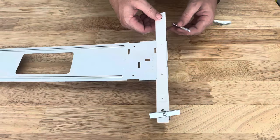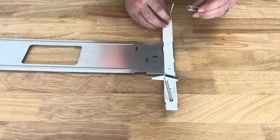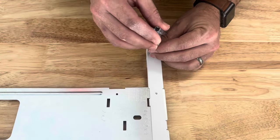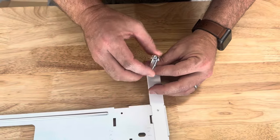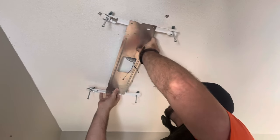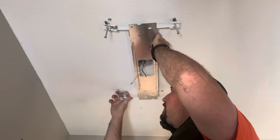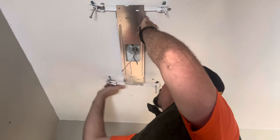That's why we need to wear glasses. You want to put these screws through so the flat side — which would be up on the ceiling — is right like that. Then you're going to take the toggle bolts; they close like this and then they grab on the ceiling. So you're going to pinch it to where it's open in that direction, get it started in the middle, and push it through — it'll go in the ceiling through those holes. Remember, you want the hang side towards the smaller wall. Line it up and push; you might need to pinch the toggle a little bit and push it up through those half-inch holes. It might be a little tight, but it should go on up.